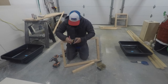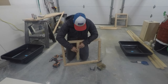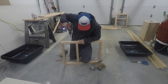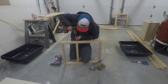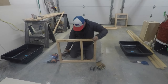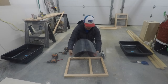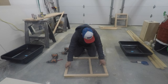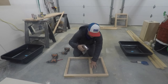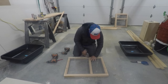Now that we have the outer frame, I'm going to mark an 8-inch spot in here, and that's where the watering bottle and the food will be placed for the rodents. Now that the frame is built, we're going to take the quarter-inch hardware cloth — John went ahead and pre-cut this to size — and I'm going to take my T50 stapler with 3/8-inch staples and go around the perimeter and across, putting plenty of staples into the screen.